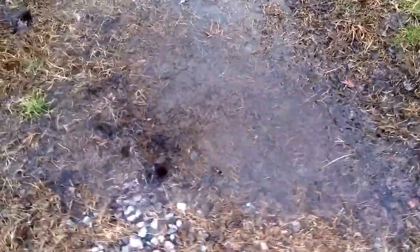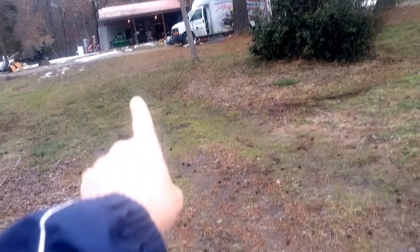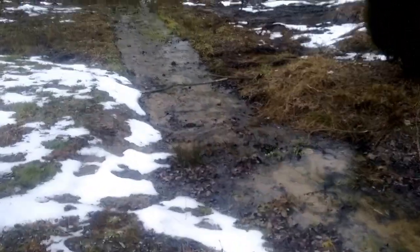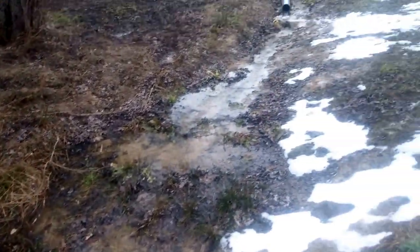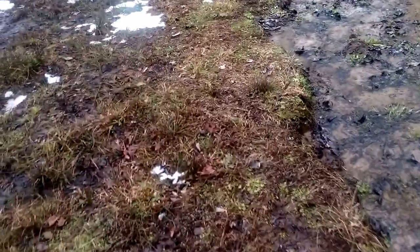You can see that just on the outside of the gravel, so I've got to come in here and add gravel here and a little bit on this side, and we're good. That gives me good access from back over there by the barn across this way. This water flows right down across a little ditch that I dug last summer — it's not really a deep ditch, it's meant simply to capture this water flow and give it a place to travel without getting out into this marshy area.